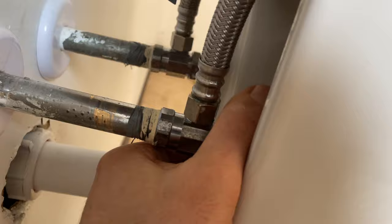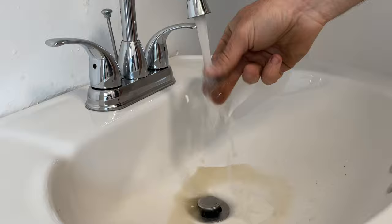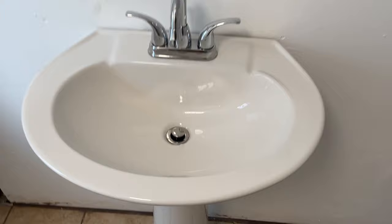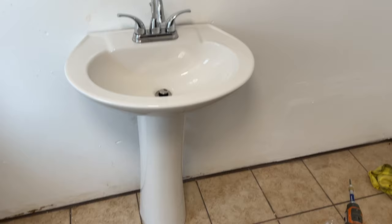Now we can turn on our valves and test the water and check for leaks. So far no leaks — which is what we want. Let it run a little bit, double check — looks like we are good. The faucet is all done. The only thing left is to run a bead of silicone along the back to fully seal it to the wall. You can also do one on the bottom but it's not really necessary since you already have the screws and nothing is leaking. Thanks for watching — check out my other videos on this bathroom remodel and all the how-to videos!